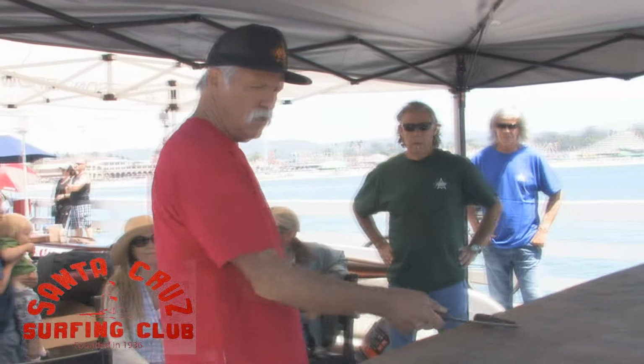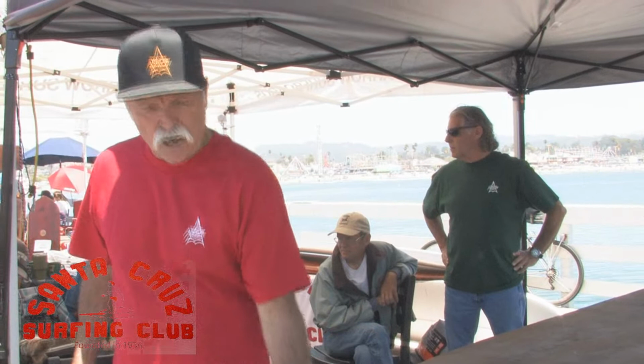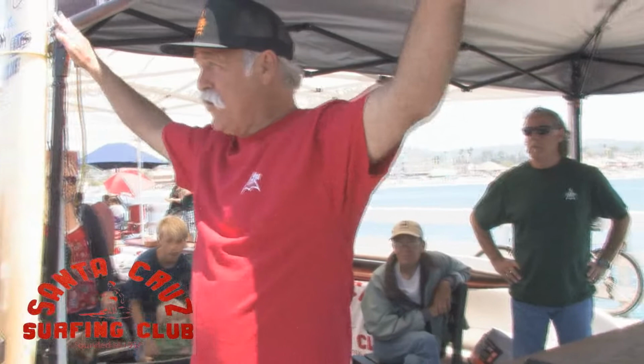This is just a draw knife here. What I'm gonna do is bring this bottom rocker up to here, and I wanna bring the tail rocker up to the bottom. In other words, I wanna put more rocker in the board. I don't want to do it with the sandblock. I want to do it with my machine.